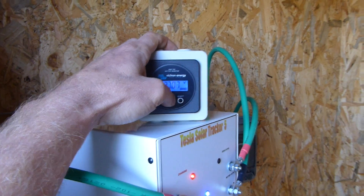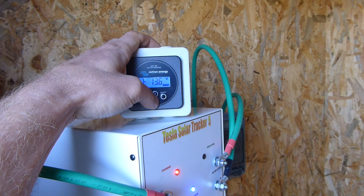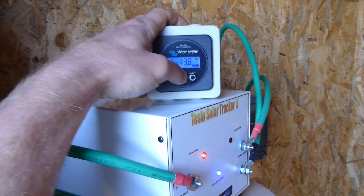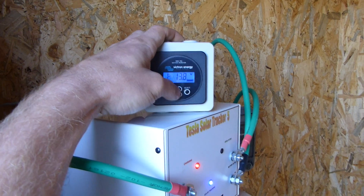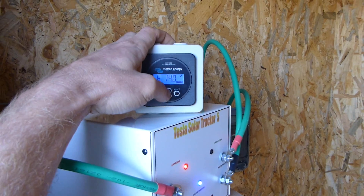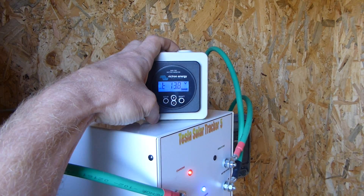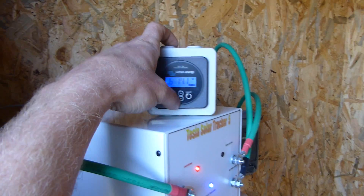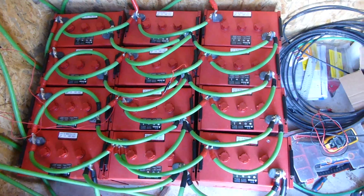So you can see the voltage climbing. And then this is the midpoint voltage, which you can see is a little bit different. The battery monitor will warn you if this gets too high, and then you have to take action. This is probably normal — it just takes a little bit longer for the charge to get to that center battery. There is a little bit of difference, but it does go catching up. And when I measure after charging — after they've been charging for a day — they're all even.